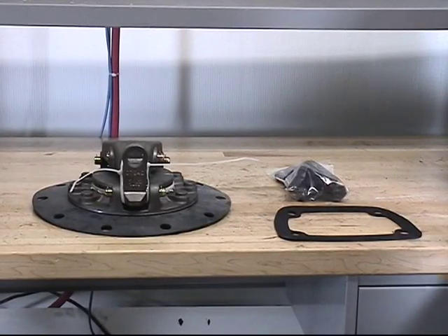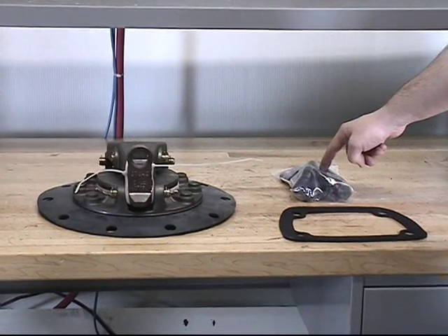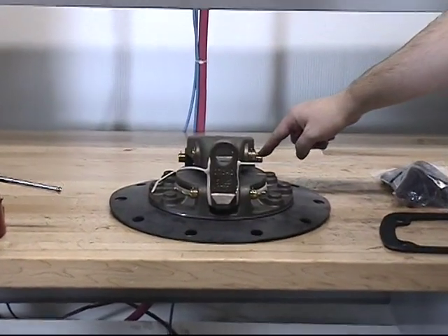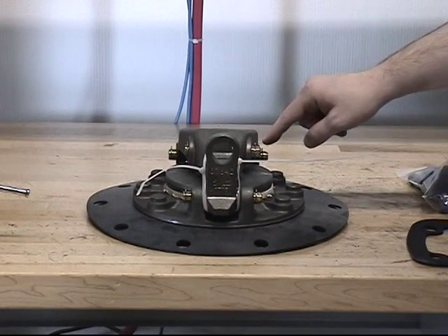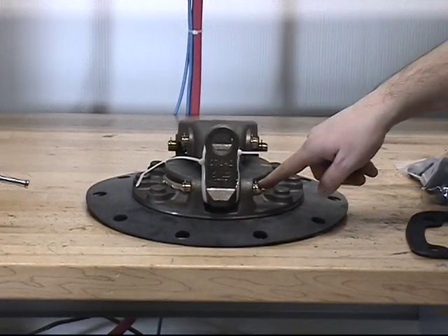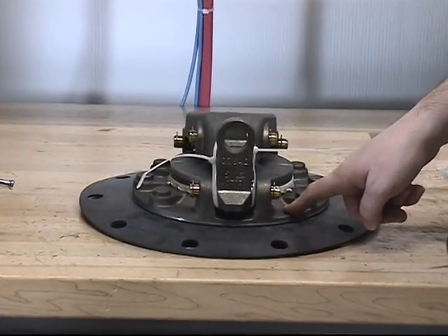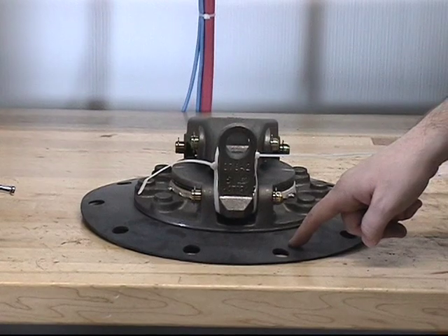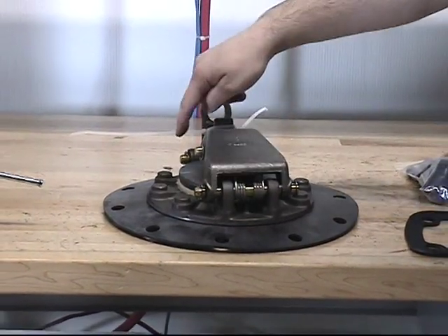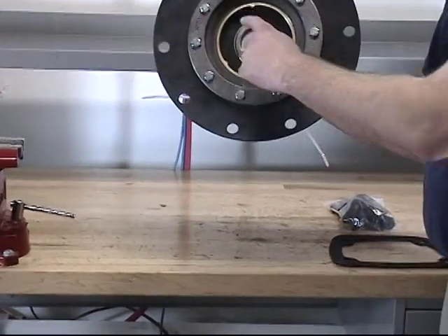The parts included in the member assembly kit are the cover gasket, the cover bolts and the bolts used to assemble the base to the housing, the clapper arm assembly, the clapper assembly rod, the clapper assembly, the hook rod, the hook assembly, the air plate, the diaphragm, the spring, and the six retainers that go on each of the rods.